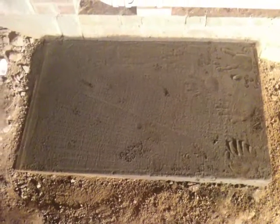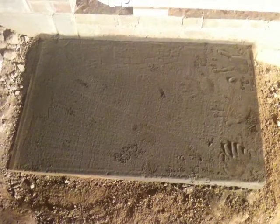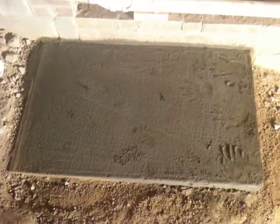It's ready, and hopefully this week we'll have some good-looking stuff here. I don't have the electrical in yet — that's part of what I'm doing this week. It won't be up here; it'll be coming from over there and running across, then down. I'll have a little junction box right here, hopefully with a waterproof connection so that if it sprays, we don't have any electrical issues. There will be a breaker on the electrical box, so if it starts to short due to water, it'll snap.